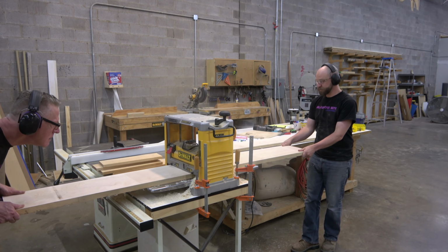All right, so it's starting to look like a thing. Two quick things. One that we learned from doing the prototype is that on the prototype, I was using a traditional table saw blade, which has the teeth that stagger like this. That was leaving little V troughs in the bottom, which is just extra wear and extra stuff that I don't want there. So we traded out for a laminate blade, which has basically square teeth, but every other tooth is missing its corners. That makes a much more even bottom, as if I were using one big dado blade, which I don't want to do because this is taking equal from each side as I flip it around in there.